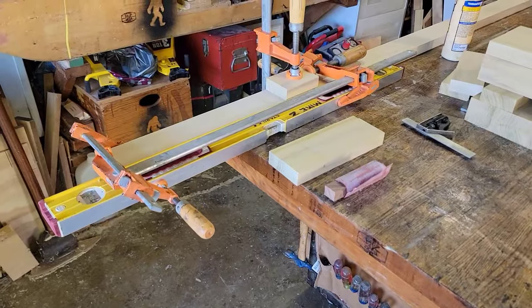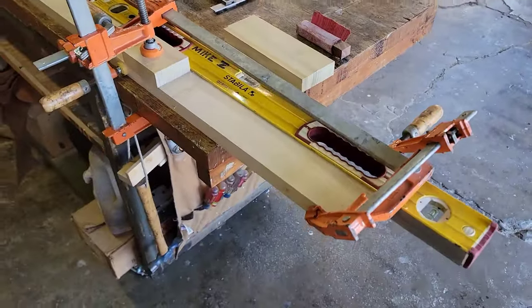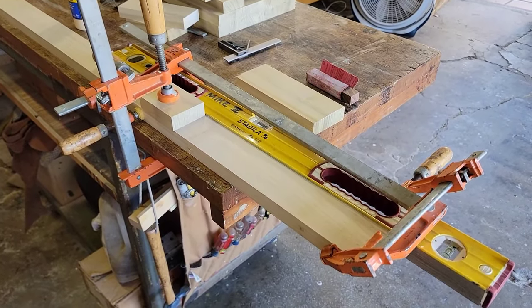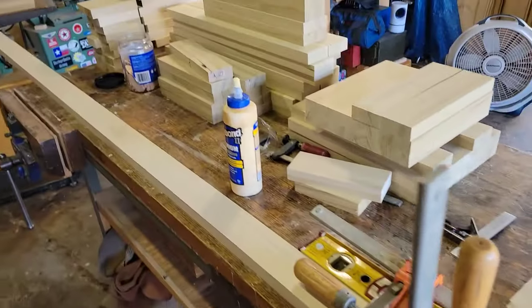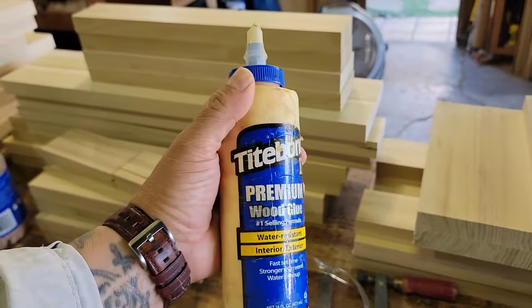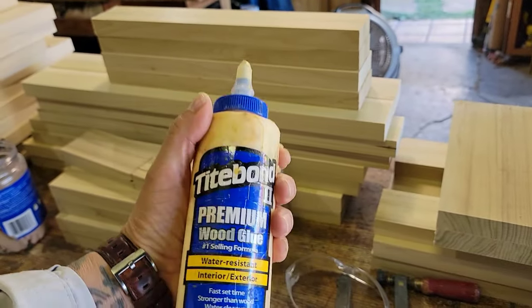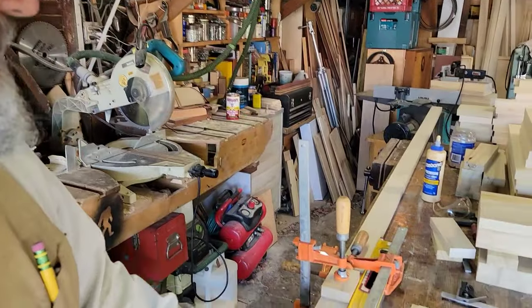I was just going to do that first part of the video and leave it, but once I did this I thought it was pretty interesting and people might want to see it. I had no plan — I just got here this morning, started working, and figured this should work. On dry time: if you're using Titebond Two — I've been using it for years, think it's the best there is, no foaming out like that gorilla glue stuff — in 20 minutes you can typically pick your parts up and run them through the saw. I'll let this go longer because of the end grain. The biscuit's going to do a lot of the work there. I gotta get back to work — have a good day, I'll catch you in the next one.